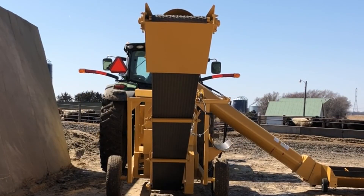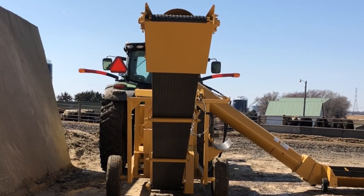You'll notice a distinct whine on any of our new roller mills — do not be alarmed. That is the rolls rubbing on some belting that we use to assure no grain gets along the backside of the rolls coming out of the hopper. That will be a wear-in item after a couple loads of corn.